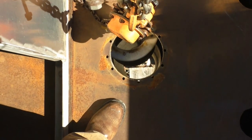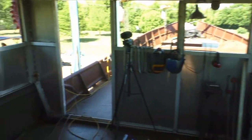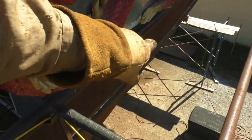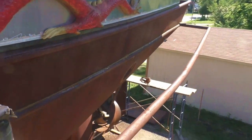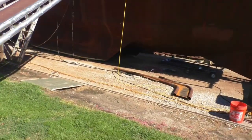We've got the doublers cut for the back of this but nothing else has happened back here yet. Looking down at the rudder down below — she's still hanging up — and there's where our Samson posts are going in. We've got the Samson posts down below that have to be ground. All the outside welds are done and the rough part has been knocked off — a lot of welding on the back end.